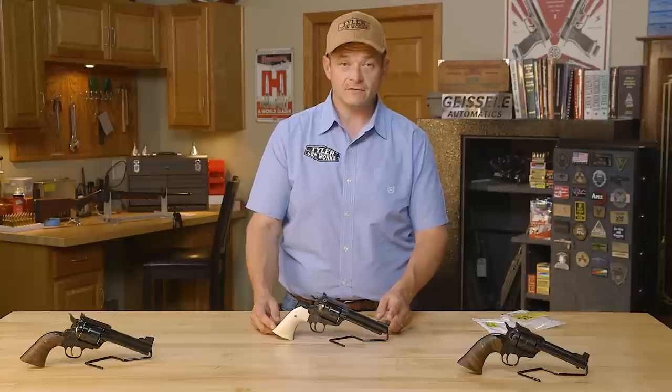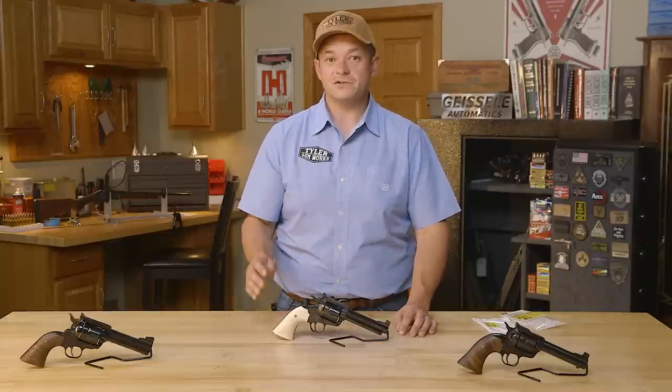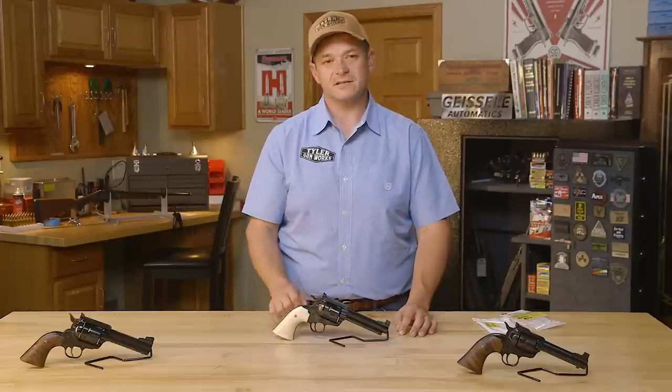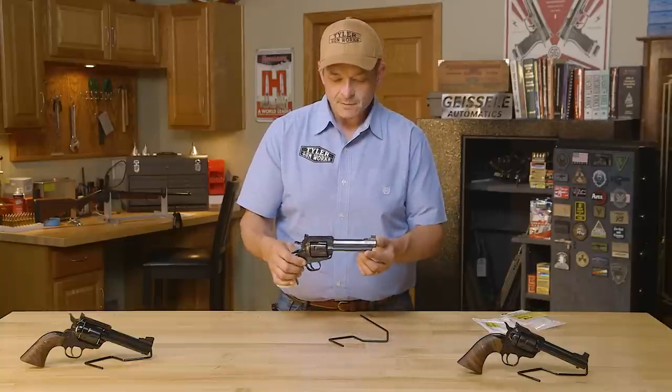He'll go through heights with you, because what we do is design these, solder them on, and then mill the height to the proper height so that you actually shoot to point of aim. It's surprising how many people go out with a Ruger revolver and just shoot, but when you truly sight one in, the accuracy you can get out of these is phenomenal. So we decided to go ahead and go with the octagon barrel.